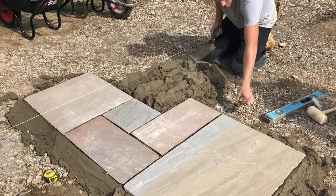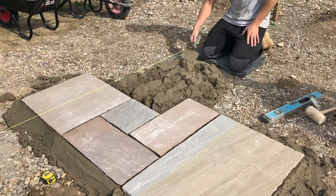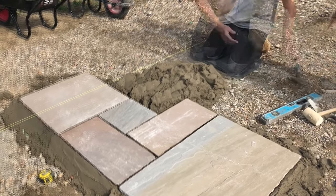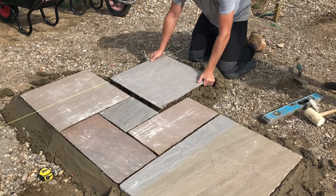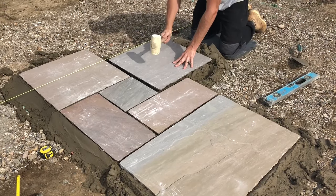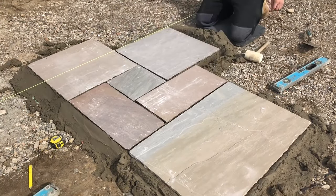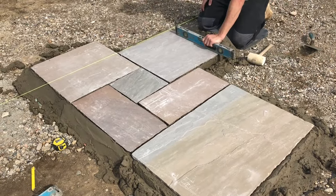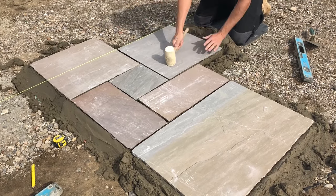Use a shovel or a brick trowel to spread the freshly mixed bedding material in a layer that is roughly 25 to 40 millimeters thick and extends over an area just larger than the paving stone that is to be laid. Ripple the surface of the bed so that there is some give when the paving stone is placed. Position the stone, allowing for the appropriate joint thickness, and tap it down to the correct fall with a rubber mallet, checking the level with a spirit level.